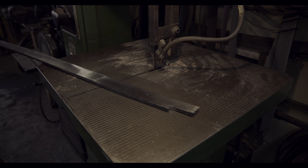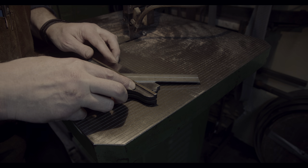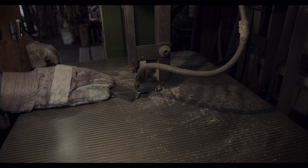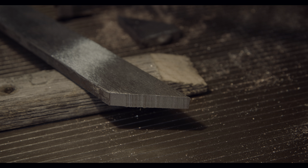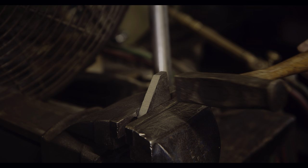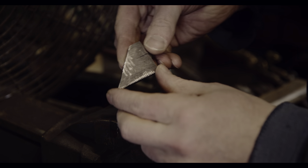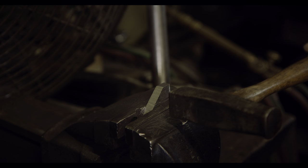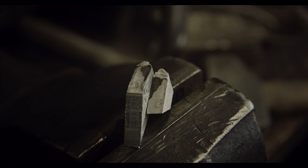The next step is to cut in a reverse tip that I will then forge over. The reason to start with the reverse tip is to maintain the pattern flow. The cut-off piece will also allow me to inspect the welds. In this particular case I will also stress test them to get an idea of how strong they are. Once I manage to separate them, we can also take a look at the contact surface. The shiny parts were welded and the dark parts were not — this is not a cause of concern, because I already knew that close to the tack weld there was a gap that would not close up.